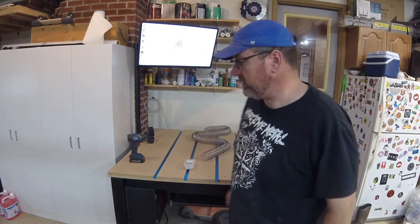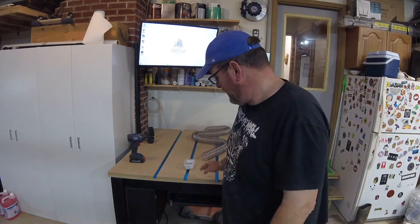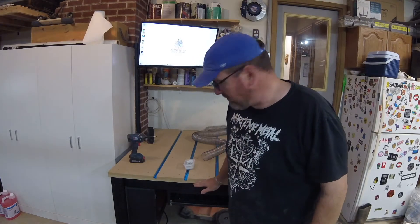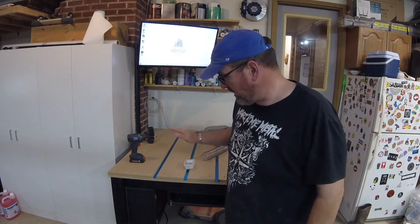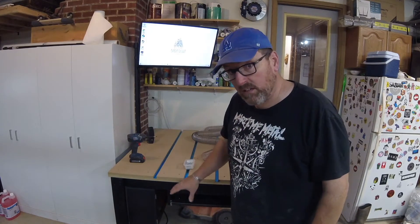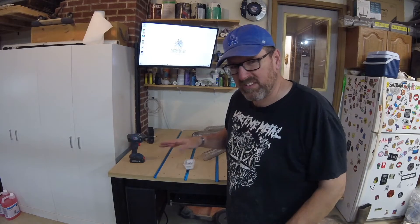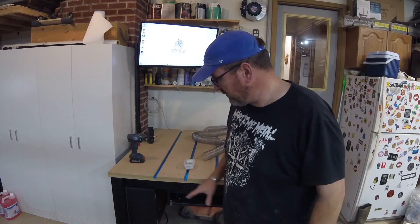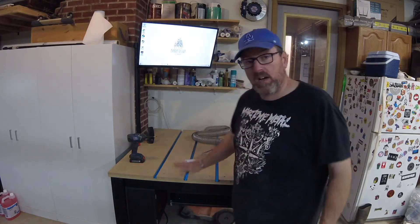The tabletop is now down permanently. The three-quarter piece of MDF becomes a permanent tabletop, hooked down to the 2x4 frame below. I should mention I have adjustable feet on the bottom as well, because 2x4s are tough to make into a perfectly level table, especially on concrete — this way I can level the table off. Then on top of that I mounted the T-track, deciding how I want everything laid out.